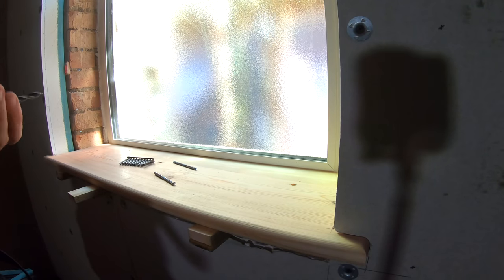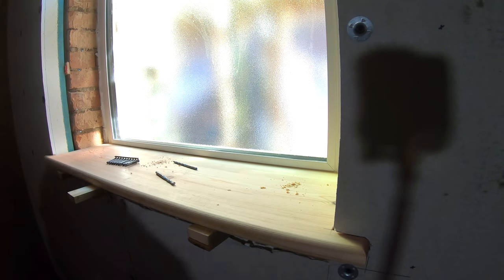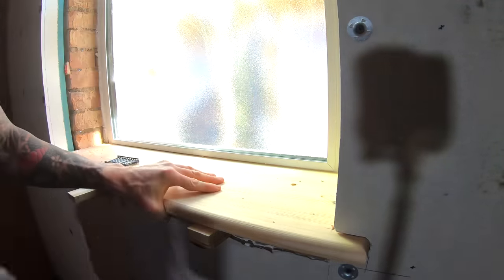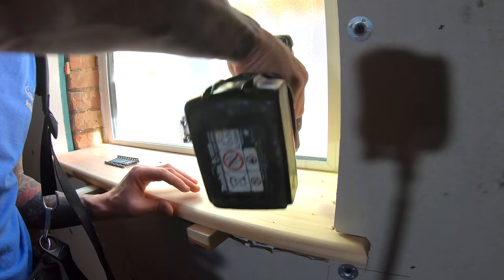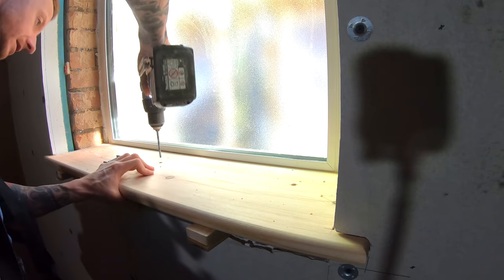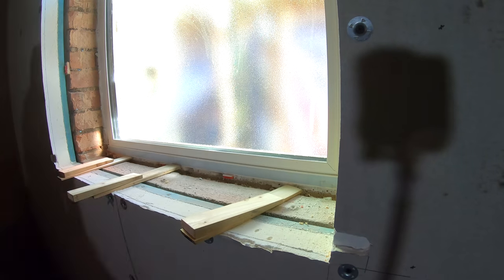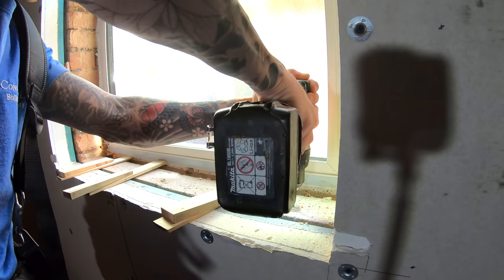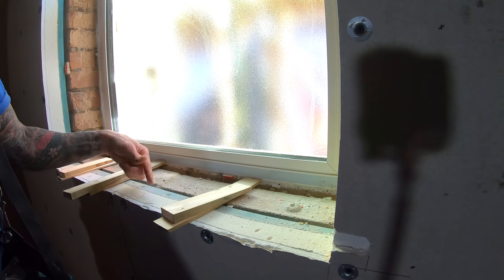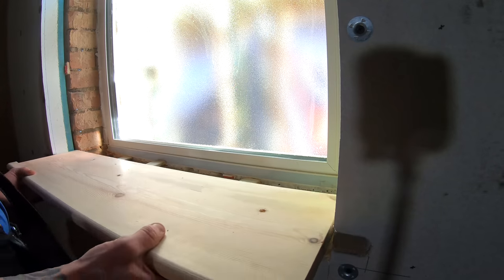I'm going to use my 6mm wood bit. I know where I want to be — I'm not worried about it being level at the minute, I'm just trying to make my holes. Keep it pushed back against the window — take a little mark there, a little mark there, a little mark there. So now I know when I remove this sill I've got hole, hole, hole. I notice that here I'm actually in the joint, so I'm going to move this fixing over so I get a nice positive fixing — especially as it's in the middle. I don't want to be fixing into this perpend; I want to get straight into the block work. So I'm just going to sit this back on and re-drill that. All I need to do is just fill that old hole with a plug and it'll be completely fine. Right, get my plugs in.